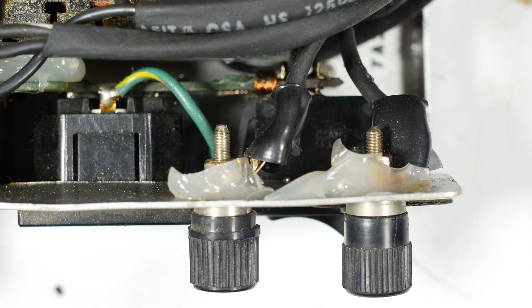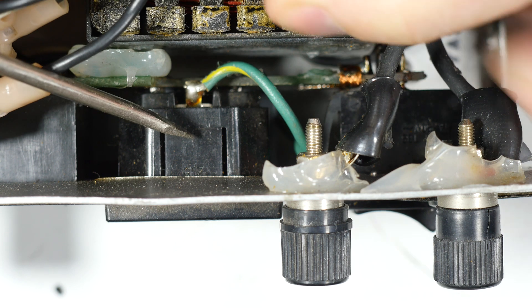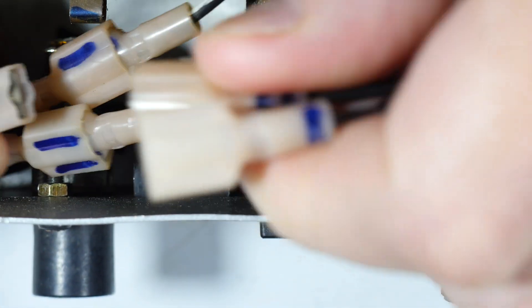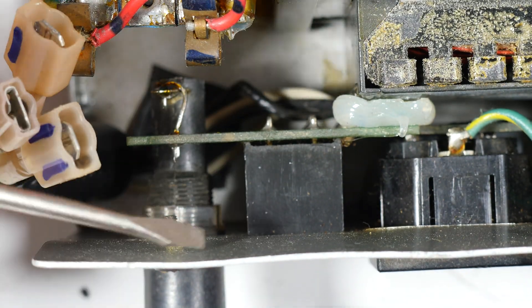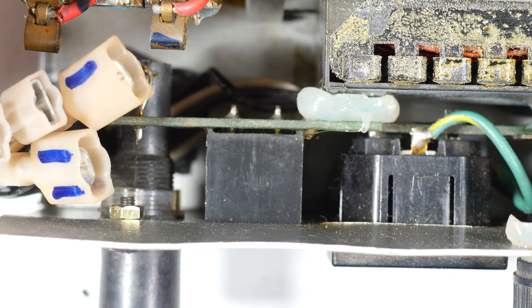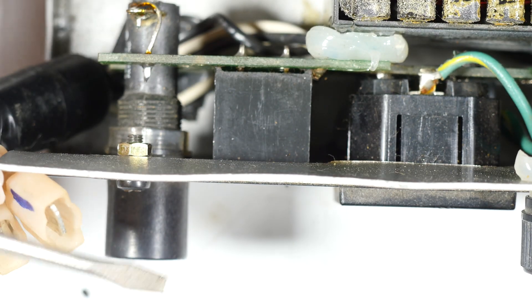Let's do this again, only a lot closer. This is the connection for the 9 volts AC; this is where the AC plug comes in from the wall. These are the AC lines going to the transformer. This is the switch that converts from 220 to 110 — it's on a circuit board that actually came out of a really old printer, so I just snatched that out and repurposed it. And there again is the fuse.